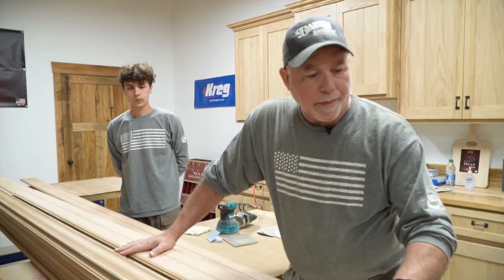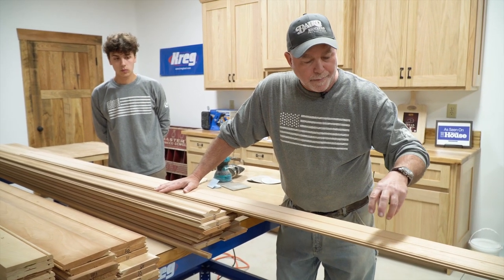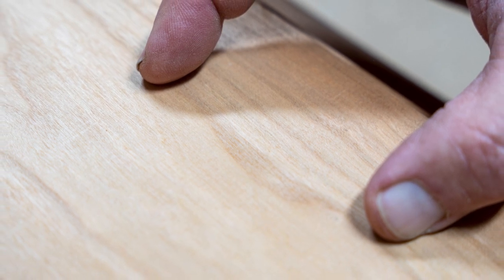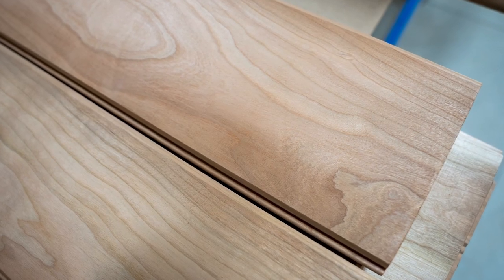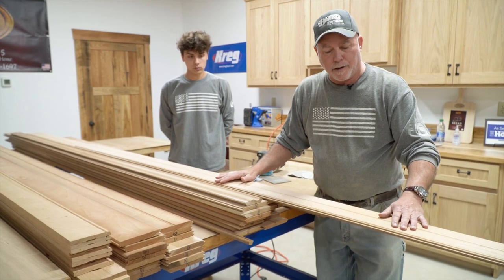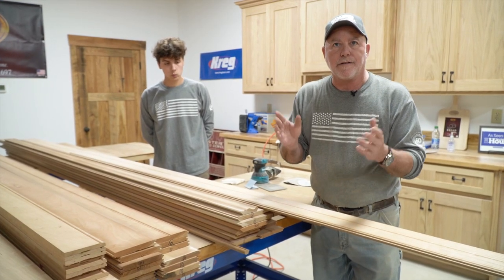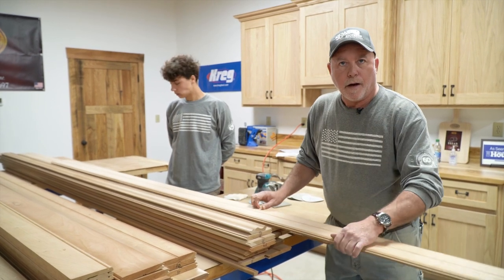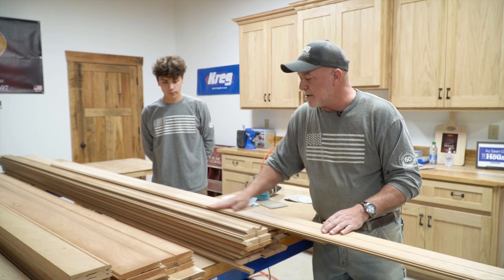This cherry Philly fence material is a 5/8 by 5-inch face — beautiful cherry lumber. It's gone through our millhouse — they run this through the molder and we want to accomplish somewhere between 16 to 20 knife marks per inch. That's what accomplishes that beautiful smooth finish. To go one step beyond, we're going to go ahead and sand. Why do you sand? You want to minimize the knife marks. Just in handling the boards, the bare wood will absorb oil from our hands. We want to get rid of any smudge marks — sliding the boards around puts a little scuff mark on it and closes the grain, so it'll accept stain or varnish differently than once it has a nice clean sanding.